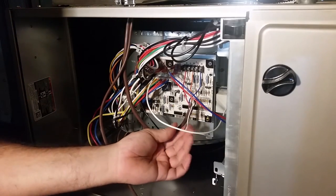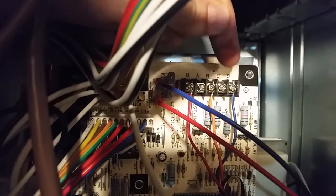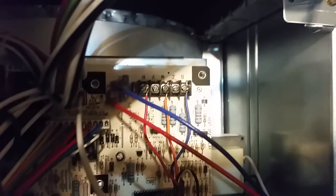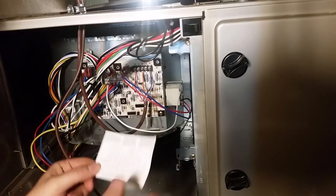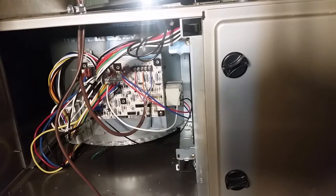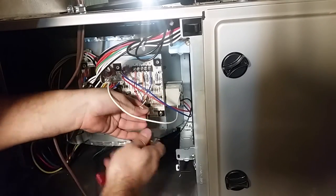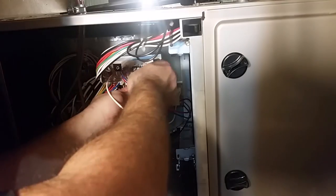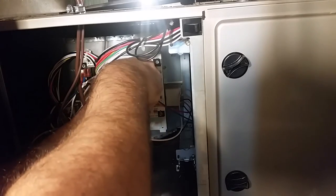Now I'm down in my crawl space looking at my furnace, and I can see right away that several wires aren't attached. I think both the C and the Y aren't attached to my furnace. I'm pretty sure the Y was attached to my thermostat upstairs, so I can refer back to the picture I took to make sure. I'll relabel these wires and attach them. Since I'm down here, I'm going to add labels to the other wires as well — I've got the stickers from the new thermostat so I might as well use them. That way, if I ever take the wires off the furnace, I'll be able to put them back in the correct spots. I don't have any wire strippers, so I'm just using a razor knife to break the seal on the insulating plastic — it just peels off after that. I do this to both the white and the black wire, making sure to label them correctly.